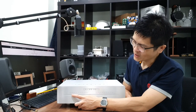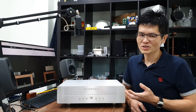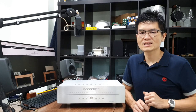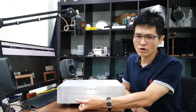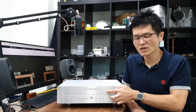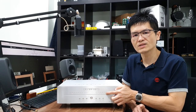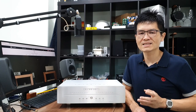It is back to operation mode where AES1 lights up. You may ask how to check the filter setting, since there's no display to tell you whether it is in slow or sharp filter. You can do this by going into configuration mode and hitting the mute button to check. Hit mute once — as the mute engages, the input LEDs turn on and off from left to right. Hit mute once again and you'll notice the 1x LED and 8x LED turn on, confirming configuration mode. The selected filter was slow filter because the 1x LED is on. After a couple of seconds, you'll be back to normal operation.